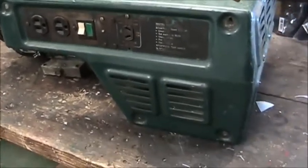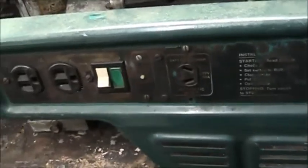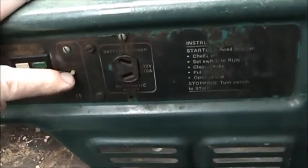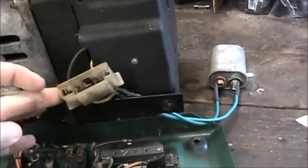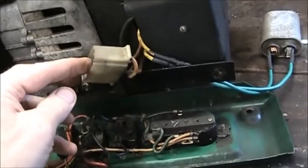There are supposed to be four screws that hold this front cover on. When they're a little hogged out, we'll have to weld that in and drill it back out. The on-off switch basically just goes straight to ground to shut it off. The reset switch is just wired on the 12-volt side. There's one modular connector here — white wire and black wire on the outside, that's your 120. The two in the middle are your 12-volt.